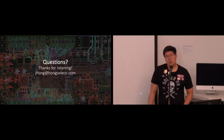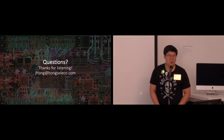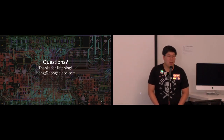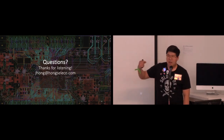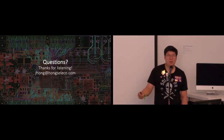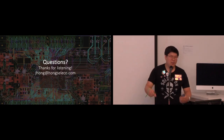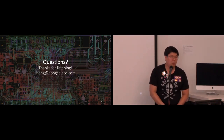During Q&A: at work I've had boards X-rayed since we have partners with that equipment. Before I learned to use conductive fabric to probe for hidden traces, I relied on X-rays of boards to find blind vias and trace where they went. Over time that method became less necessary, but I can foresee X-rays still being needed — there are situations where I'm not allowed to take apart a board, so X-rays become absolutely necessary.